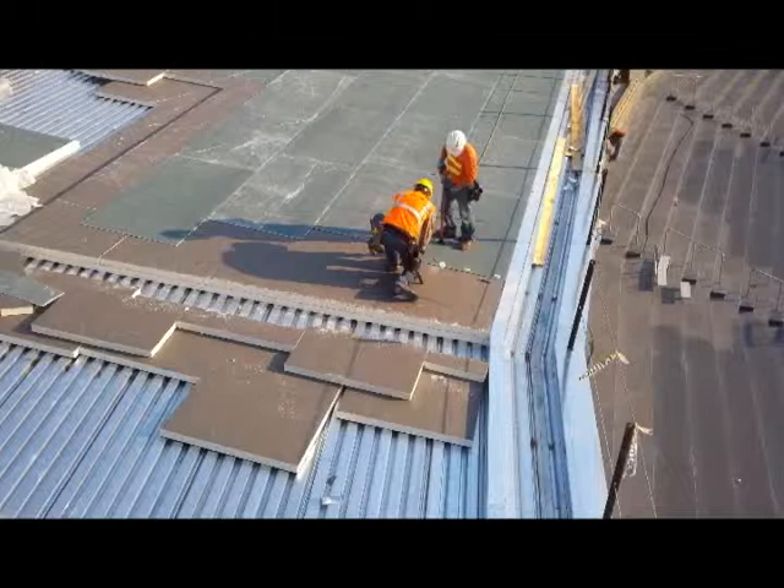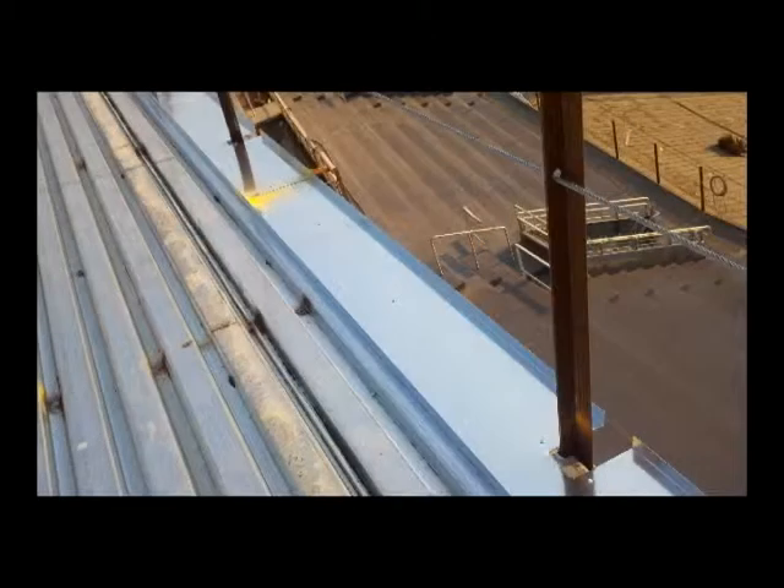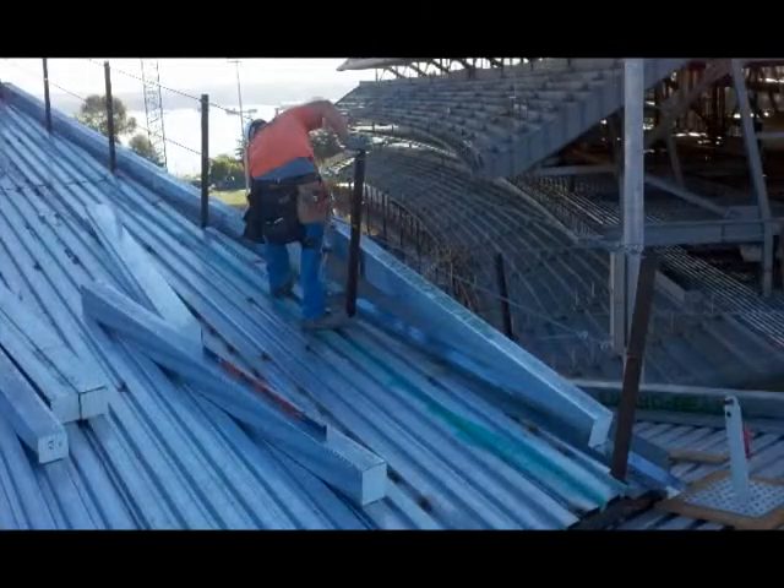An extremely simplified two-piece installation method for any type of roof deck, metal or wood: mount the metal capture track on the roof decking, drop the E-Curb into the track and fasten, and the installation is complete.